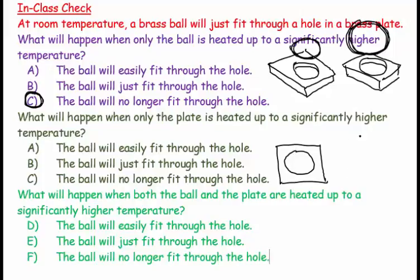But now we heat it, and the question is, what do you imagine when this plate is heated? Some people imagine that the metal expands, and so we end up with a change like that, where the actual outside dimensions of the plate get bigger because it's expanding, but this neck and this collar also expand, so the actual area of the hole must decrease. That's a common assumption. Turns out, unfortunately, not to be true.